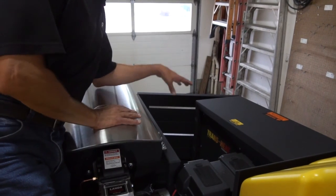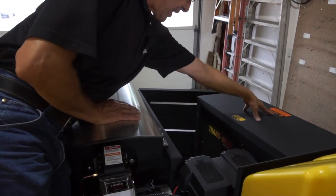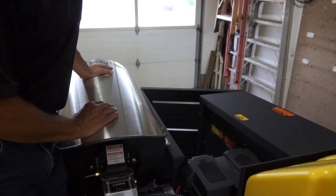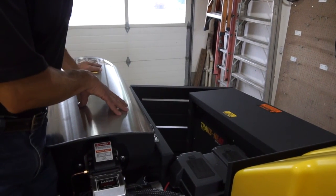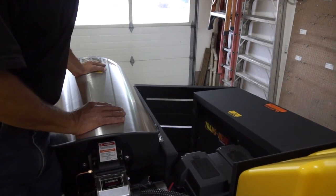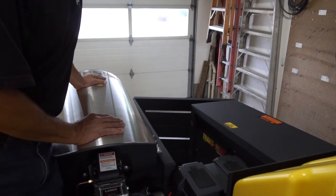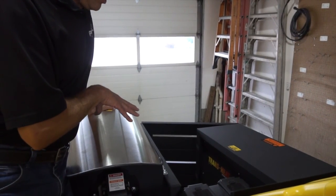In front of the battery box at the lower end of the trailer, behind the passenger curbside compartment, is a heat transfer box that utilizes the exhaust from the engine. Water from the tanks is transferred through that system and preheated to raise the temperature approximately 15 degrees before it is run through the burner system on the pressure washer.